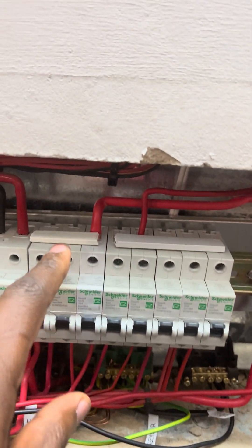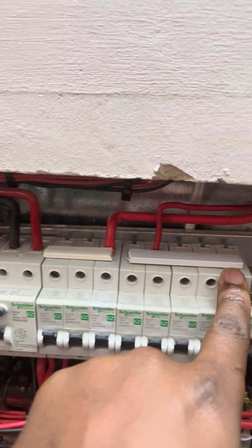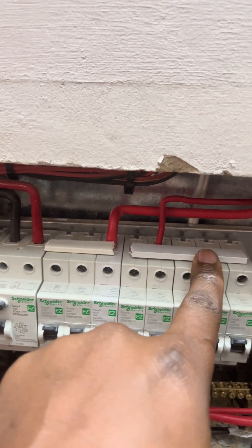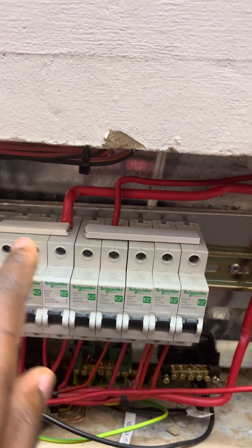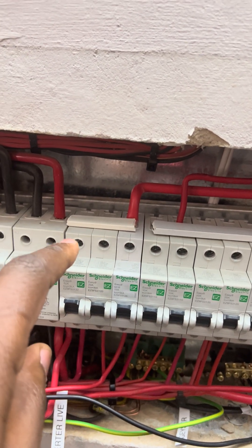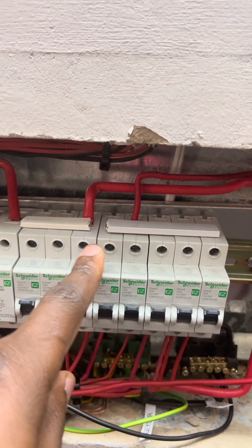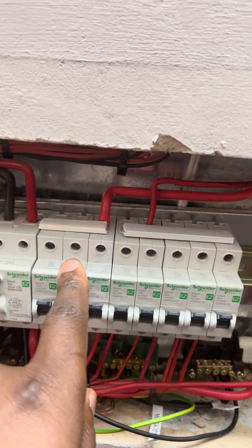So far that's what I did. At the top here, I split the bus bar — we had one long bar linking from the geyser to all the lights and plugs. I split it into two. Now I've got the geyser, stove and the new plug on one section, and from there going upwards are the plugs and all the lights in the house.